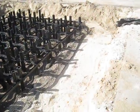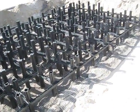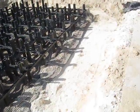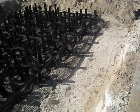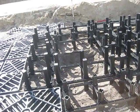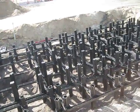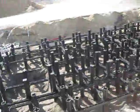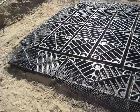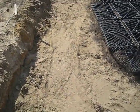You can also take note of the geogrid that is around the perimeter, separating the 95% compacted soil from the 75% to 80% compacted soil in the middle. On the outside is aggregate or whatever was originally here, and in the middle is imported beautiful loam that smells like it has worms — lots of bacterial growth. Over here is a set of SilvaCells which is largely done; all we have to do is put a little bit of extra fill around the perimeter.